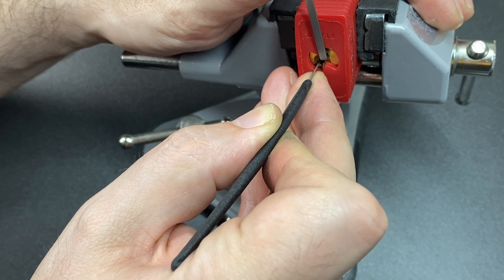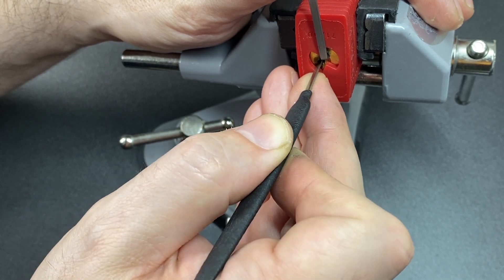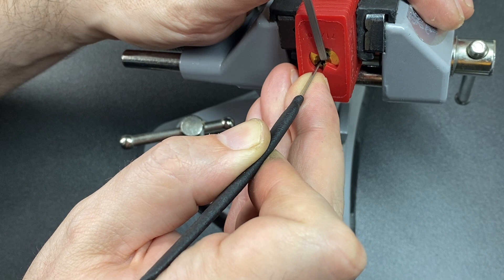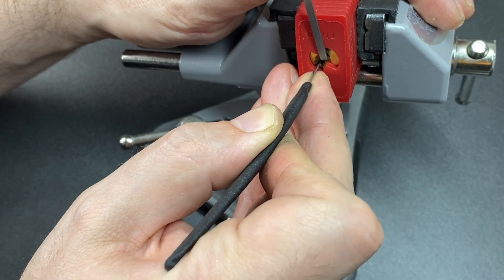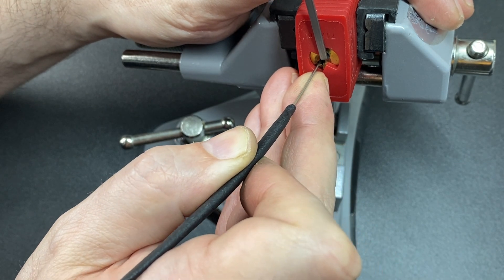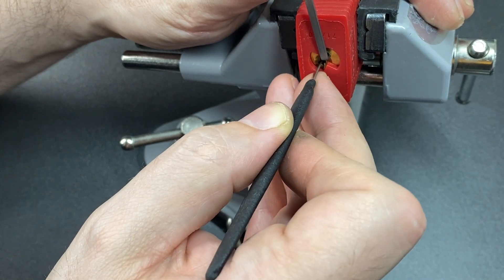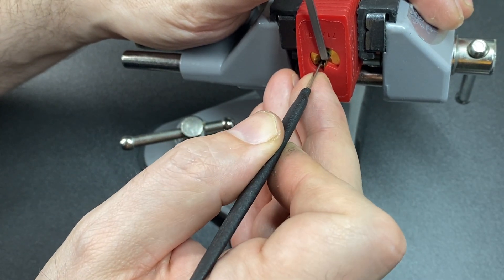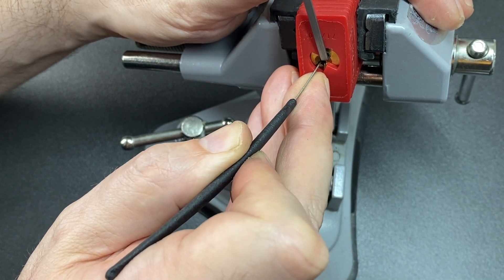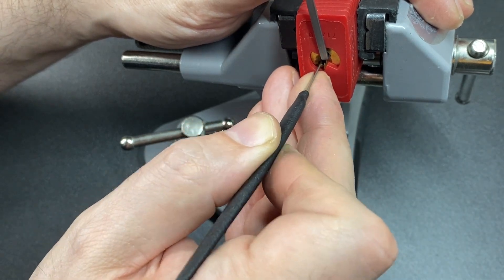Back through — little click on five, little click on four. Just go back through: pin six feels like it's binding, counter-rotating but quite hard. Nothing on five, four. Oh, something dropped — I think it's six at the back. There we go. Three: nothing. Two: can't rotate, and we are sort of stuck. Just releasing that tension while tapping on some pins — just hit pin three — back into the full set.